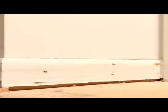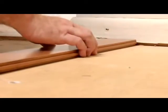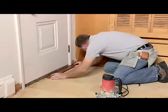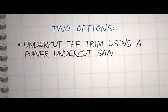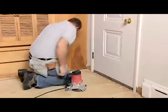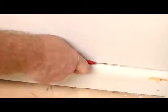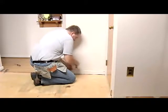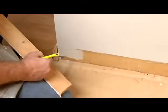The next part of subfloor preparation involves removing the trim. Some trim is installed with a gap to allow for carpet installation, and that gap might be high enough for your floor installation. To check, slide a piece of the wood you're planning to install under the trim board to see if it fits easily. If it does, you can leave the trim alone. If it doesn't, you have two options. The first is to undercut the trim using a power undercut saw — this lets you cut away some trim without removing it, then install a quarter round molding to cover your expansion space. The other option is to remove the trim. To remove it, use your utility knife and pry bar: make a cut at the top of the trim board, then gently pull the trim away from the wall. If you're reusing the trim, write the locations the pieces came from on the back — this will save you time when reinstalling them.